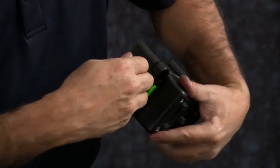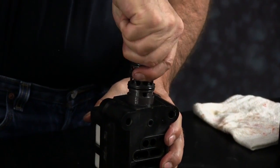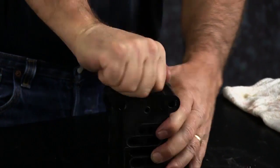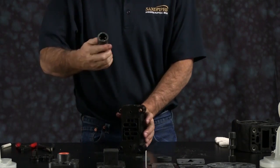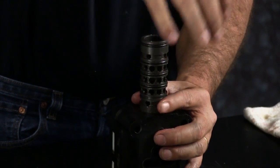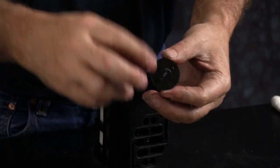Grease is applied to keep the items from catching, binding, or cutting while assembling components. You want to slowly press the sleeve in while twisting, and this keeps the O-rings from binding. Utilizing the old sleeve and spool with the removed two O-rings to help center the sleeve and spool into the main air valve assembly. You don't have to get exactly center. It'll self-align once you get the bumpers and snap rings in.